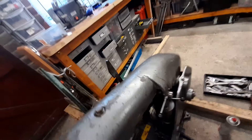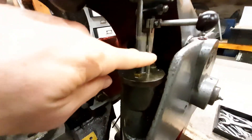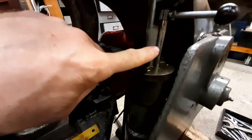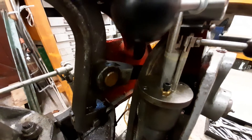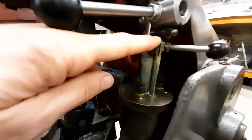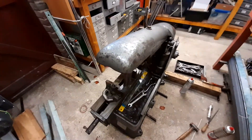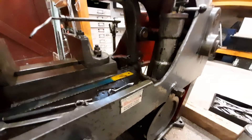I ended up having to remake this push rod as well. That actually turned out to be quite easy — the push rod is part of, I don't know whether it was a printer or a scanner, but it's one of those precision ground rods. I had to turn that and thread the end — it's really difficult to see, sorry about the light. But that actually works fine now. You can see it dropping — it goes down quite gradually.